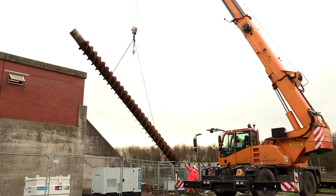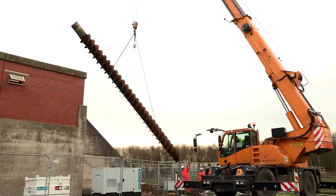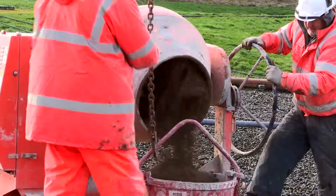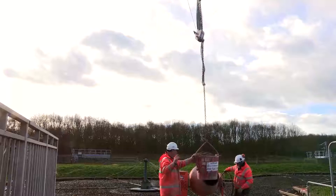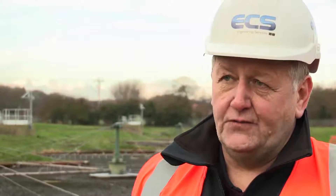The tolerance between a screw pump of this size is 5mm between the tip of the flight and the screed. If that gap becomes larger the screw pump becomes less efficient. So consequently the existing worn screed is broken out, and after the screw pump has been reinstalled it is then rescreeded by hand. We mix by hand — a mixture of sharps, cement and PVA — and we screed it starting at the bottom moving up the trough.